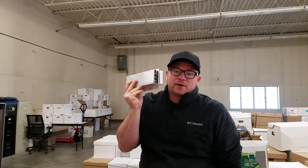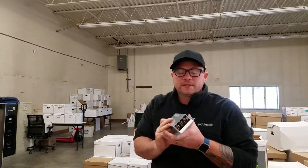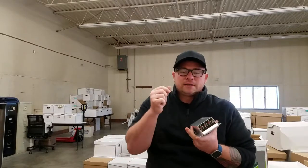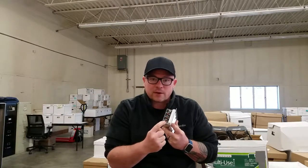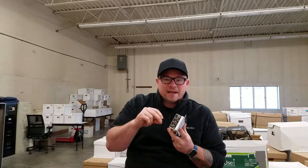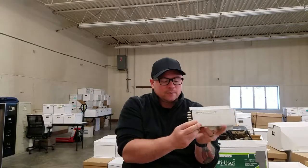This guy is doing all of the handiwork of switching the lights. The controller basically says it's time to switch to green — it provides 24-volt DC logic ground to the input. As you can see here, I've got an input light as well as an output light that lights up as the load switch does its job, grabbing the 24-volt DC and switching the 120-volt AC to the output.